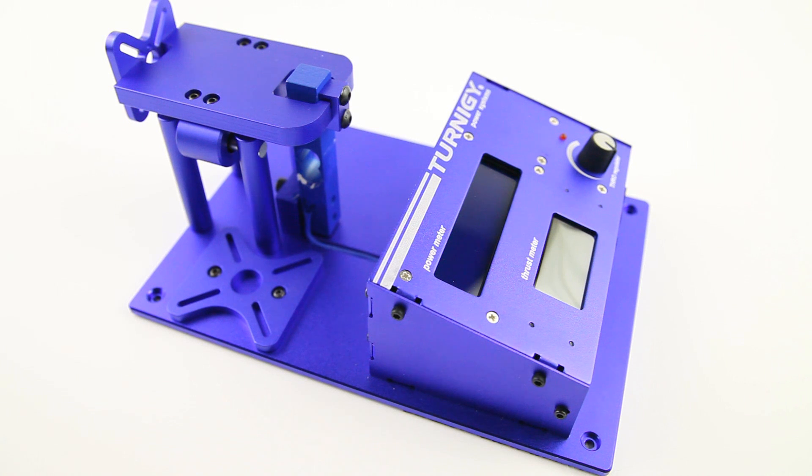What is this? It is a power meter by Turnigy, Hobbyking. It is meant to measure the power of your propulsion setup — your propulsion setup being a motor with propeller, an ESC, a battery, LiPo in most cases, and if you want to be really thorough, also the wire and wire length you are using.